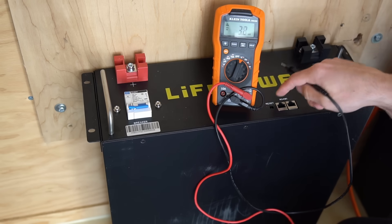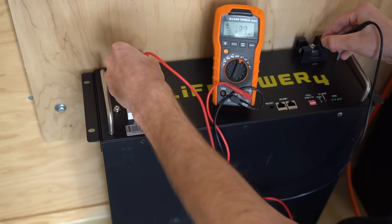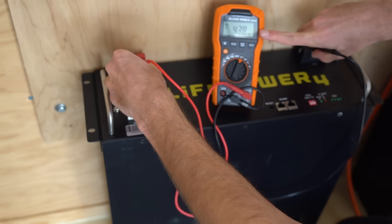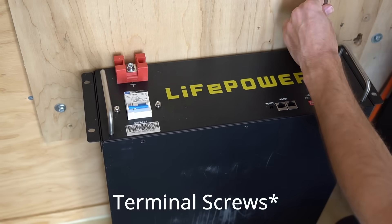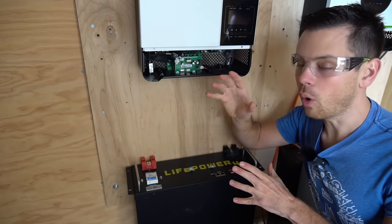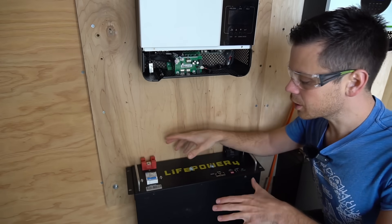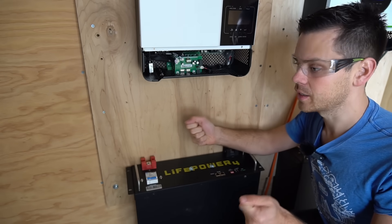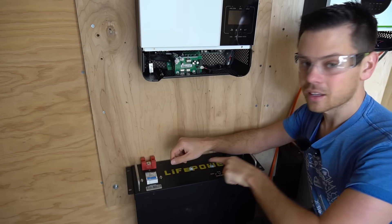If you're a beginner and want to ensure the battery is turned off, use a voltmeter and test the potential across the battery terminals. You can see we have millivolts, so this is safe to work with — practically zero volts. Now that the battery is off we can remove the battery terminals. Always connect the cables to the inverter first, not the battery. If something were to go wrong with the battery and you switched it on, you could have loose conductors, which is very dangerous. Always connect the conductors to the load first, then to the battery second.